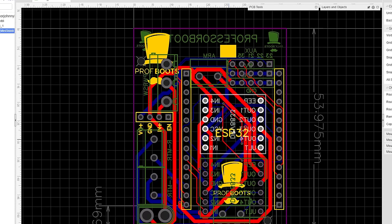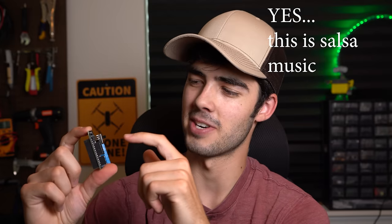So with the fancy new redesign of our arm to now use the N20 motor rather than a servo — giving us more power — it also means we're going to have to add another H-bridge to our circuit board assembly. Here's what I'm thinking: I'm going to move where the buck converter currently hooks in to the front of the board next to the ESP32, and then try and smush this current H-bridge location up just a hair, and hopefully be able to fit one more H-bridge right below it. We'll have two more blue terminal blocks — one up here to replace the spot of the arm servo hook-in, and one down here as an auxiliary. That way, if somebody wants to design a 3D printed auger for their mini skid steer, it's now a possibility because we have an auxiliary DC motor that can be used for whatever we want.